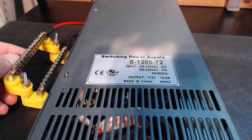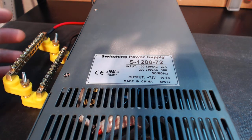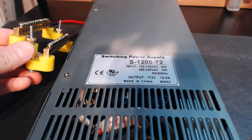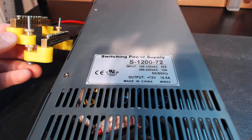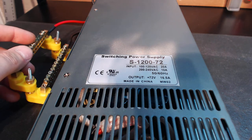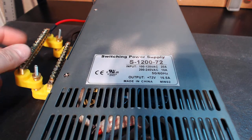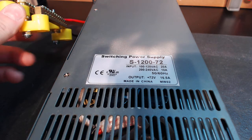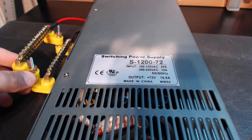I wanted to come up with a design that I've used over and over again — my modular design for terminal blocks. You can see what we have here: it utilizes thumb nuts. The thumb nuts are simply modular in design — you can remove any terminal block you'd like. These are solid brass, the same type of terminal blocks you'd find in a breaker box. They'll easily handle the power distribution from this unit. On top of that, there are 12 pin locations, so you can hook up 12 different devices on either the positive or negative.